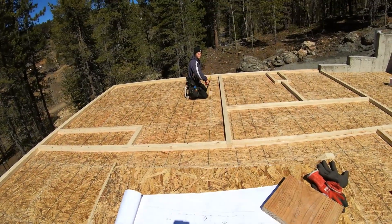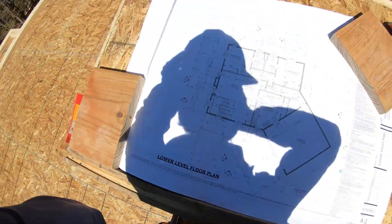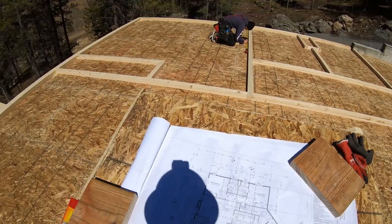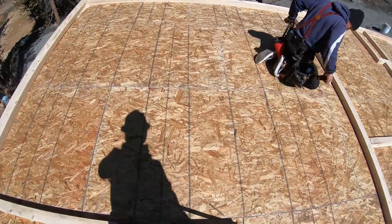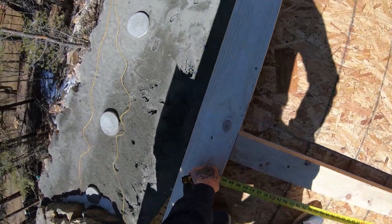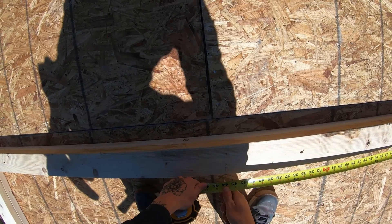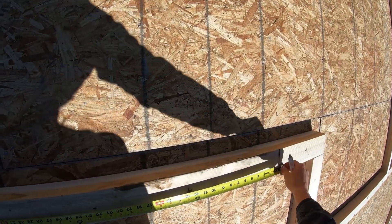When we're actually laying out windows and doors, we lay out all of those first on the whole house because those are much more important in terms of accuracy than a standard stud. So we go through the whole house and lay out our windows and doors. This is a closet door here — I'm just marking the center of it. Once I have the center, I can take the RO, which in this case is 5 foot plus an inch on each side — that's 31 inches for you math wizards.